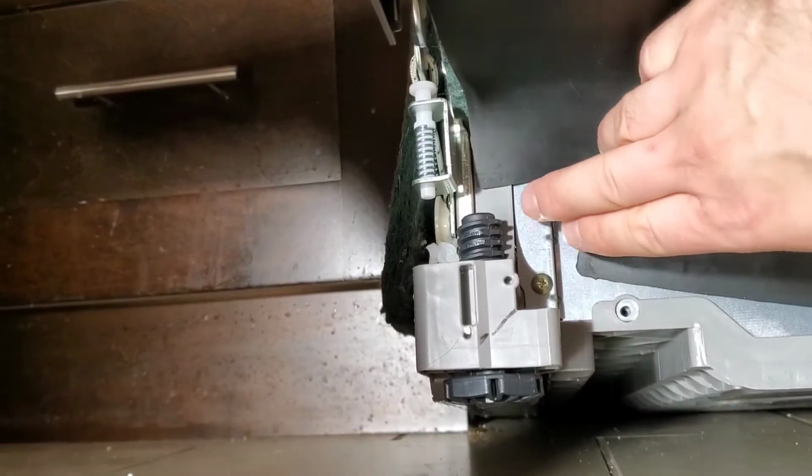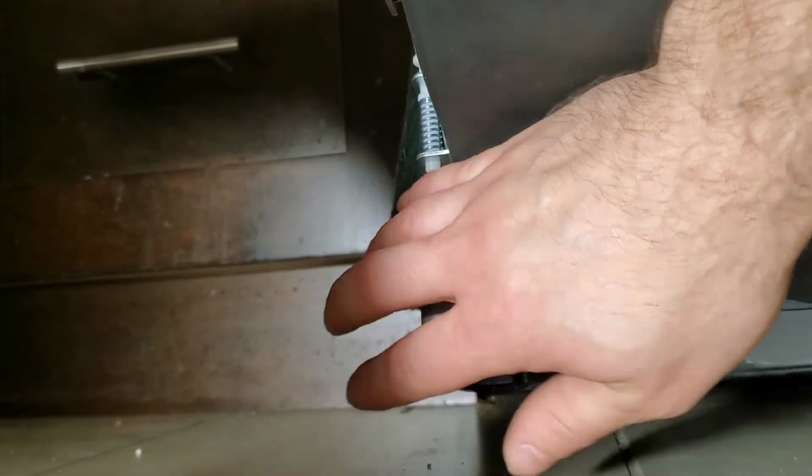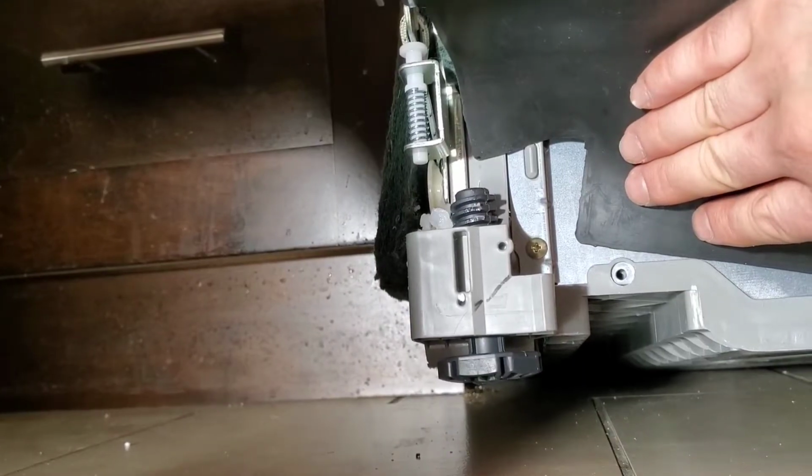So I'm looking at the space between the dishwasher and the cabinet. You can see that the top needs to go back in so they're parallel. To level and plumb the dishwasher, these feet can be unscrewed. So there are 4 feet and they can all be adjusted as necessary.